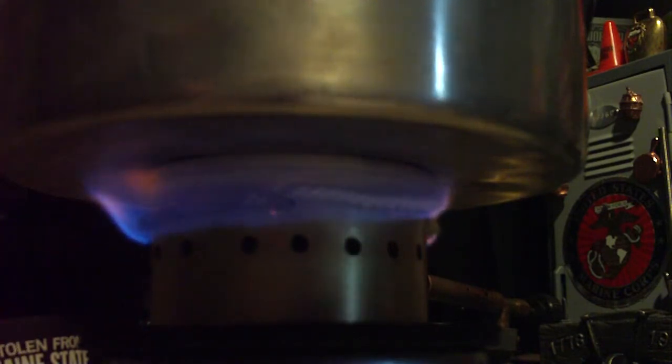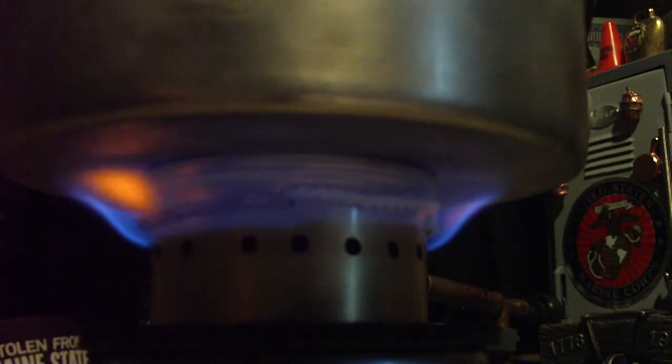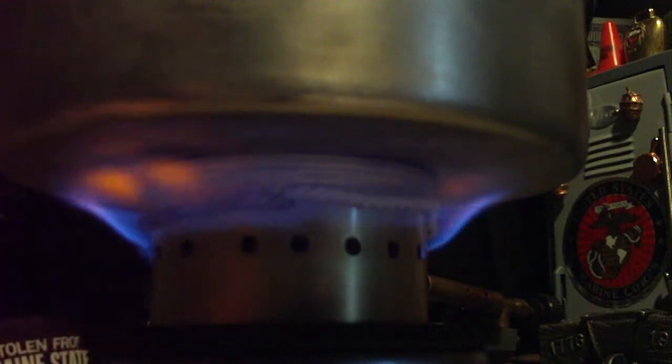Okay, I've got the alcohol soaking in the stove — one fluid ounce of methanol. Let me try lighting this. Turning on the timer. About that time the flame is all the way around the can, so that's pretty good. Kind of looks like maybe I could lower the wick a little bit. The flame is like a sixteenth of an inch above the jet holes.